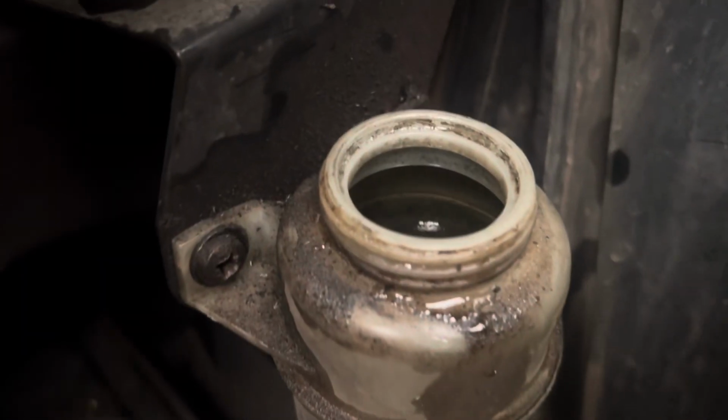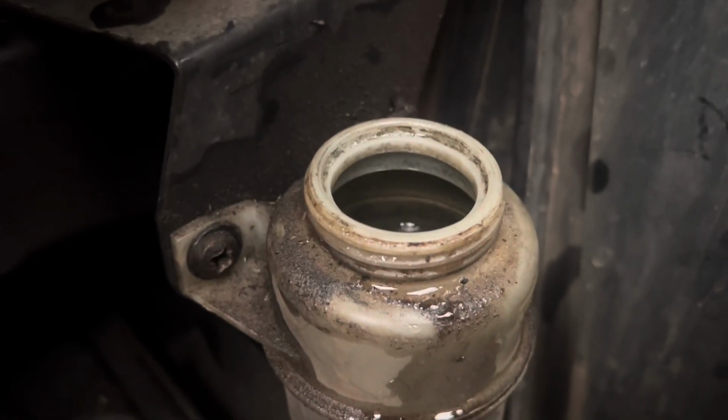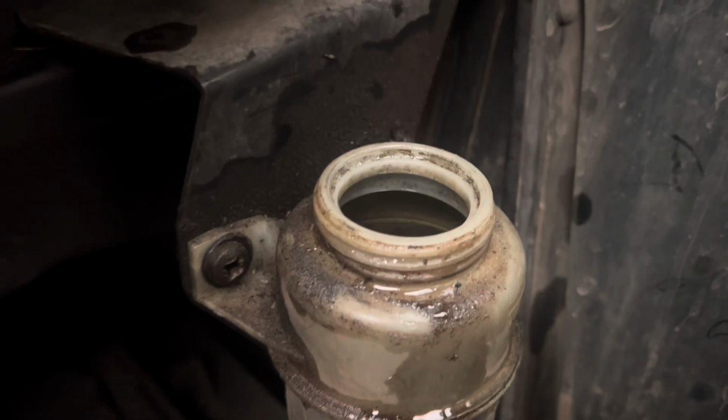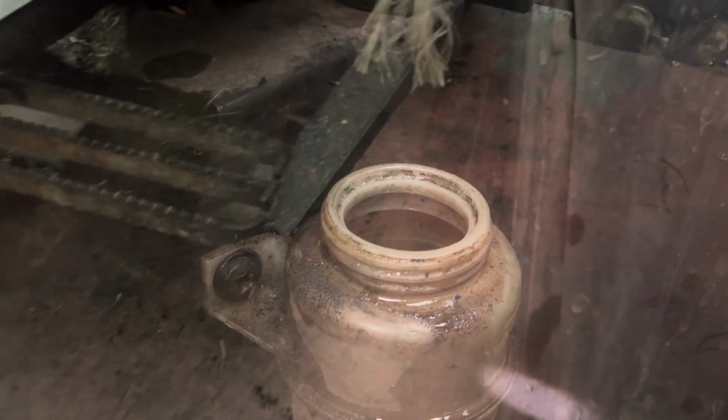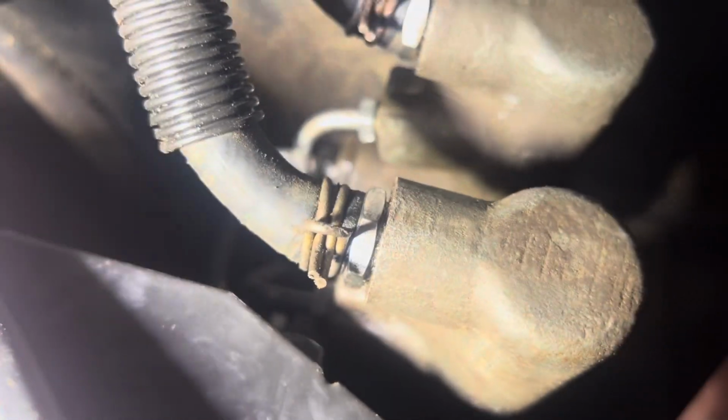So last night I left this brim full. And I said we'd slack that bleed nipple off, just let gravity take its course, it's dropped down. So that's what's flowed through and out. So we'll top this back up, and we'll try it. As you can see, there's no drips of fluid on the floor here, and yeah, that lot in there, what a sod to get to. That bridging pipe, that was something else to try and fit in, but no room.